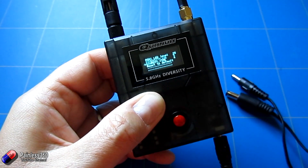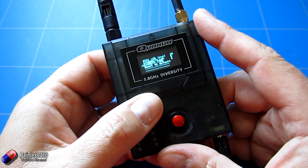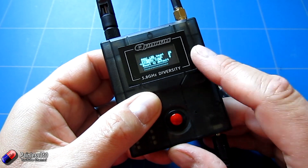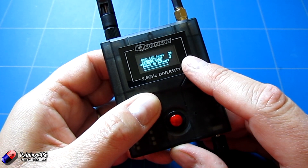There are also a couple of other useful things in this manual. There's one about the menu switch test where you can actually have different combinations of the two antennas onto the two outputs at the bottom. If you want to have a look at the service manual, I'll put a link in the description. Hopefully that clears up any confusion — including the confusion I had myself — on what diversity time is actually standing for. It's 100 milliseconds per point.